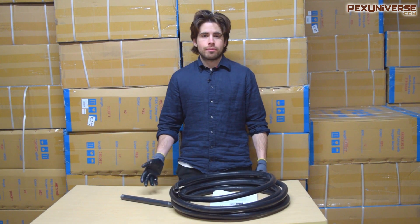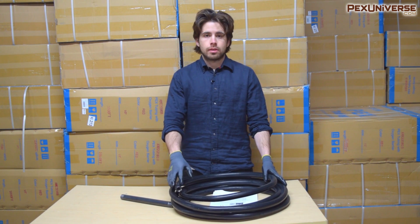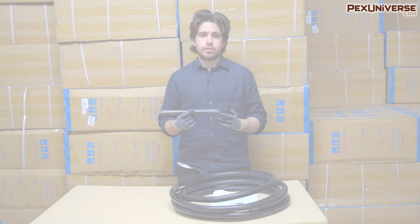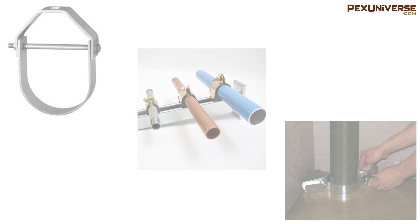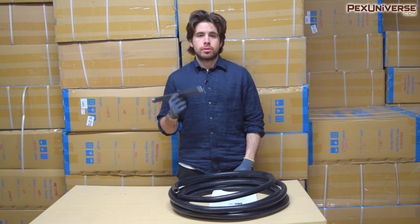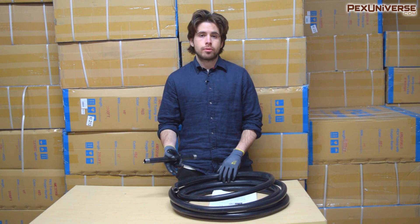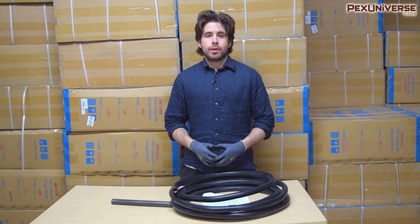One point not often referenced online: you don't need hanging supports with CSST. With black iron pipe you need a lot of pipe hangers — clevis hangers, riser clamps, strut clamps, or other supports — none of which are needed with CSST since it's so light. It's also worth noting that black iron pipe is usually imported, whereas there are several companies in America that make CSST, such as Pro-Flex, and their products are always 100% factory tested.